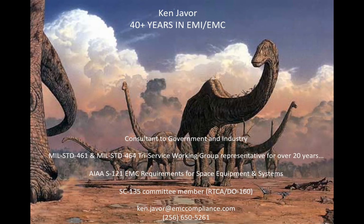On the same subject, who was just talking there, what's the frequency range of those shark fin antennas? Well, it depends. Some of them are just set up for cell bands. They'll typically have two antennas. Both of them can operate in downlinks, so that's how you get your 2x2 MIMO on receive. But for the uplink, only one of them is active. There'll be two passive elements in there, and typically a patch for GNSS and a patch for SDARS, meaning Sirius XM, if the vehicle's so equipped.